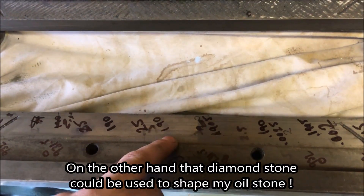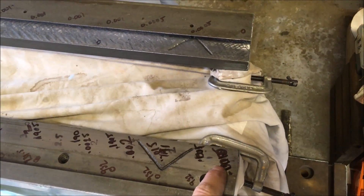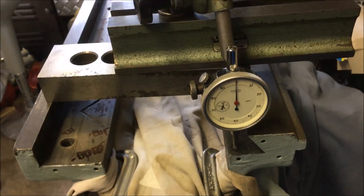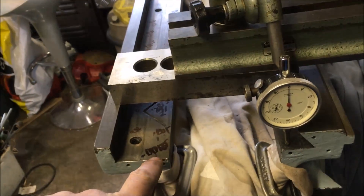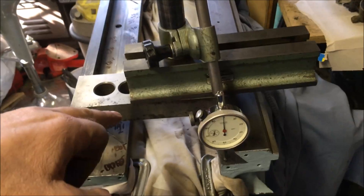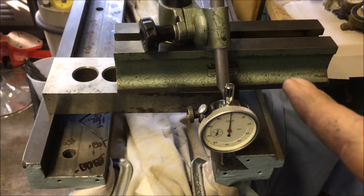While I'm here I'm going to bring this one down to parallel, then work out a datum which is the same height as that on this side. Then I can zero my DTI to this side and run it backwards and forwards. I'll take that position relative to the top of the parallel, shift it across, and find another position on here which gives me a datum. Then I can reset the jig to read the same datum without messing about with the parallel, because you can see it's prone to slip off and it weighs about two kilos.